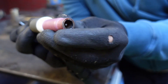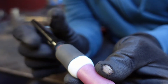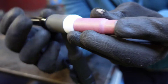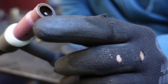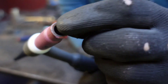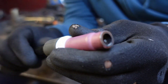Also what you want to do is leave a gap of about two millimetres. So if you put your finger at the end and then tighten the back side of the torch — it doesn't need to be perfectly two mill, but approximately. The only thing you want to make sure is that the tungsten is not flushed with the cup; you want to make sure that the tungsten is slightly inwards. Something like that. So you tighten this back.